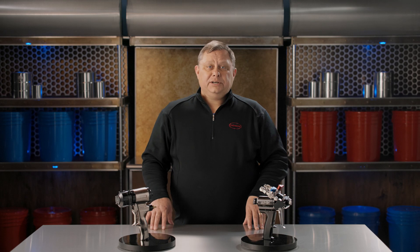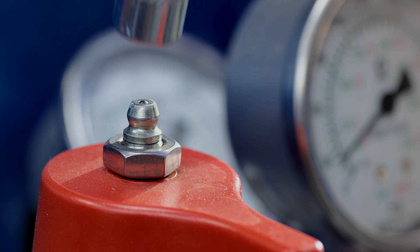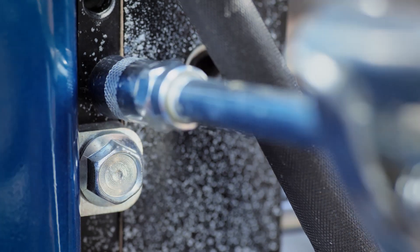Change the TSL when the material becomes a gel, darkens, or becomes overly diluted with A and ISO as needed. The grease zerks on the recirculation drain valves — red and blue if so equipped — and on the horizontal pump assembly should receive one shot of grease every month. This helps to lubricate the metal-to-metal parts and keeps them from sticking or grinding.